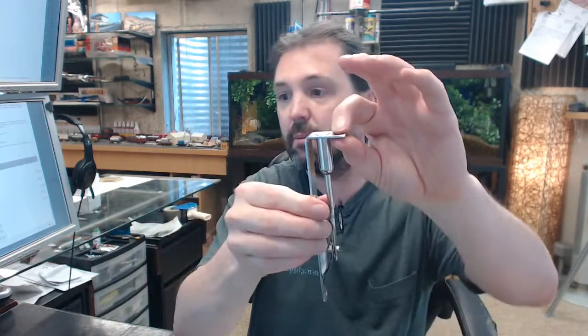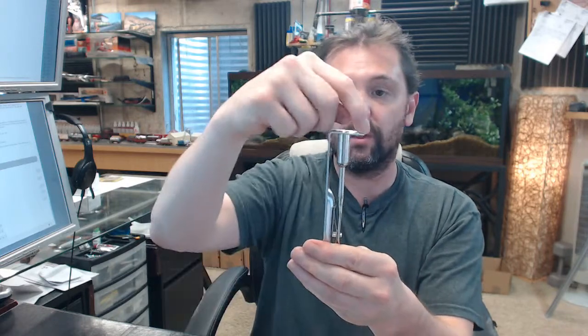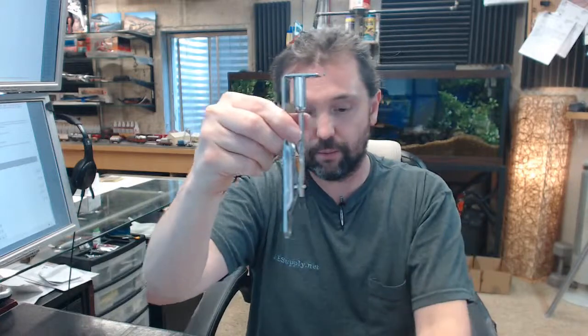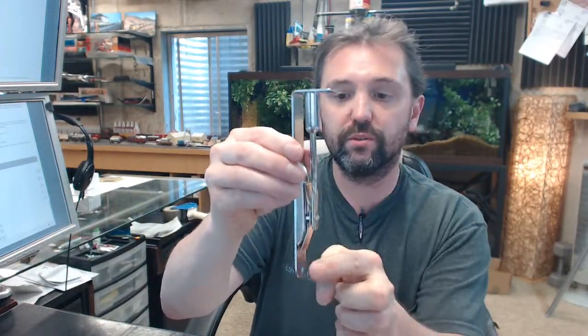I would then have the plate preparation at the top and bottom, which they call out as three quarter inch wide. So: three quarter wide, two-flute router bit, 27/32 of an inch deep, five and a quarter length, with a little bit for the face here and here. Then your preparation is completed — pre-drill your holes and you are done.